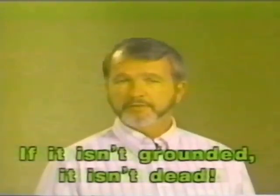And in conclusion, remember to always treat an ungrounded conductor with the same respect that you would treat an energized conductor until that conductor is securely and properly grounded. And remember, if it isn't grounded, it isn't dead.